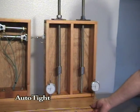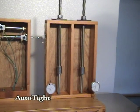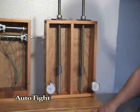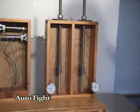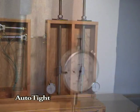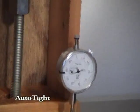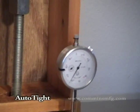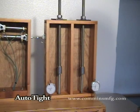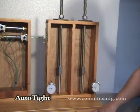The second test demonstrates the action of a shear wall with an induced looseness of only three-sixteenths of an inch. Looseness such as this is called backlash, and it can come from the shrinkage of just a pair of two-by wood plates. Backlash of three-sixteenths can reduce the lateral performance of shear walls by 40%. The dial indicators show a hundred and ninety thousandths of an inch of movement or wall flexing.